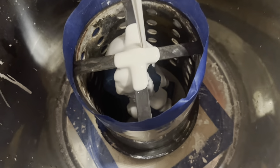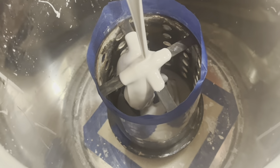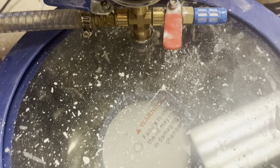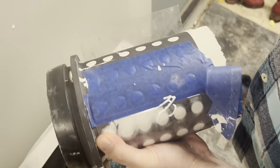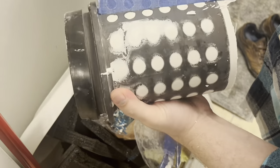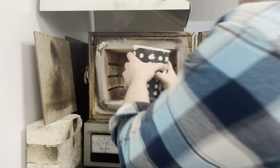If the core isn't properly supported and it breaks away and then drops, the cast is effectively ruined. There are many ways to create a core when casting sculpture. This could include having large openings at the top and the bottom of your sculpture, using nails or other embedded objects through your sculpture to hold the core, or using several small openings like we're doing for this project.